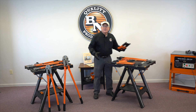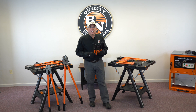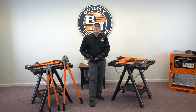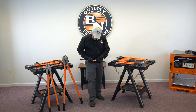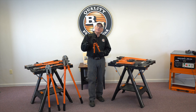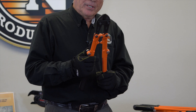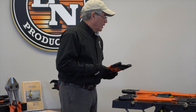It's frustrating when your bolt cutter is in your toolbox in the back of your truck and you need it up on the job site. So we've made two different types of folding bolt cutters — an 18 inch and a 24 inch — that will fit easily into the toolbox you take up on the job site. You simply push the handles in, push this button in, and the tool folds open. Now, this is a standard bolt cutter at HRC 42, just like the other bolt cutters on the market, but you have the convenience of folding it up and putting it back in your toolbox after you use it.